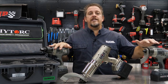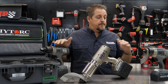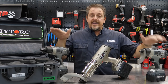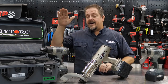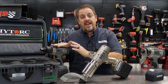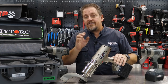We use those because we can replicate or increase the amount of torque we need much quicker than resetting a torque wrench. Now, what we have up here — we have what they call their Lion Gun or the Lion 25, the Lion 70, and then their Lithium series. These two run on 18-volt batteries. The Lion 25 goes from 25 to 250 foot pounds, and the Lion 70 goes from 50 up to 700 foot pounds. Well, we started getting well beyond 700 foot pounds for testing, especially when we got to the one-inch. So we got the new Lithium series.